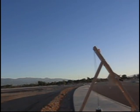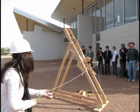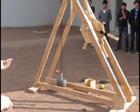At this point, I think I can get to 1,000 feet with a design counterweight of 90 pounds. But the simulation, newly upgraded with rope stretch, says otherwise — and the 900-foot result never repeats. I now believe that measurement was a freak, because the measured velocity was only 63 meters per second. In any case, I'll never know, because two weeks later the throwing arm shatters in a high school demonstration.